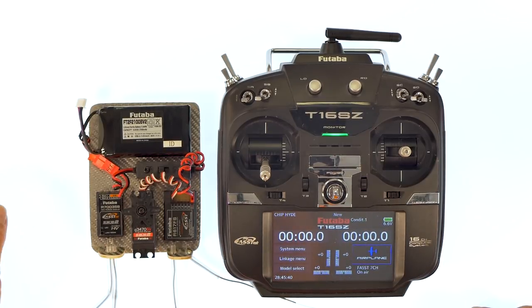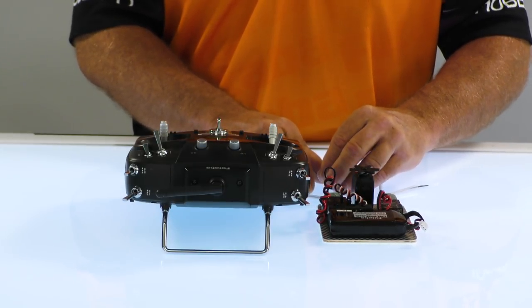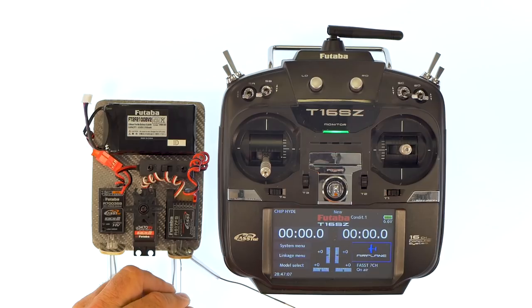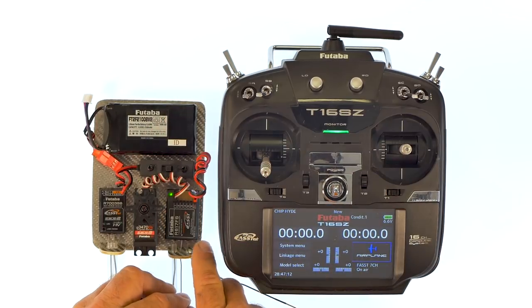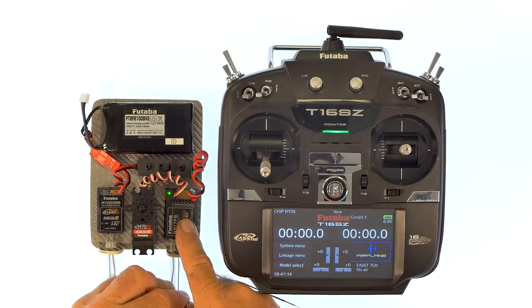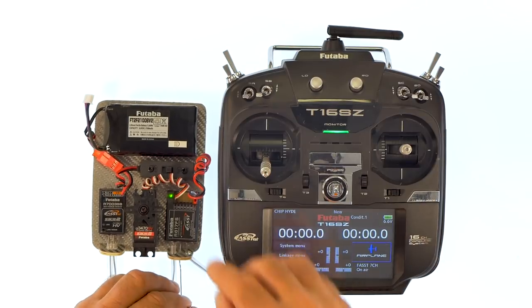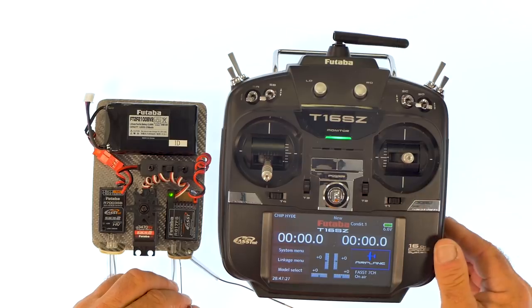Now at that point, it's a pretty simple process. Because of our little mount here, I've had to make a little paper clip to get in here, but we're just going to push this button. Now the radio is going to be talking to the receiver. So we turn the radio on, we turn the receiver on, the light will be flashing green, you reach in, push the button, you'll see the light flash red three times, let it go, and now your radio is talking to your receiver. It's that simple.